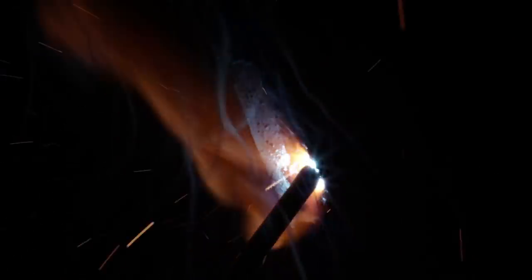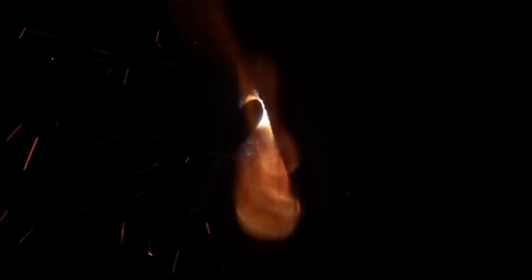Right here on our hot pass, we're using the whip — go up and back down to the top of the weld and you pause. This method makes a little dime look. I'm doing a little whip and then down, but whenever I go down I touch both bevels so it can fuse properly. I ran mine at around 83 amps but you could do 85 to 90, I just didn't want to blow through. I ran my amps around 85. When you restart you don't really need to buff down the beads, you just start real quick. Don't let it cool down so whenever it's warm it ties in perfectly.